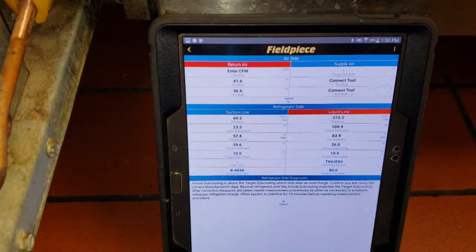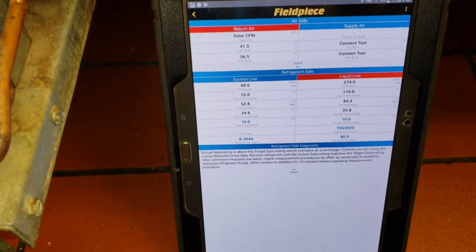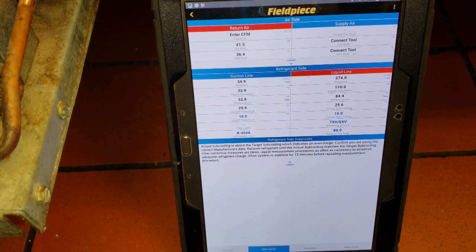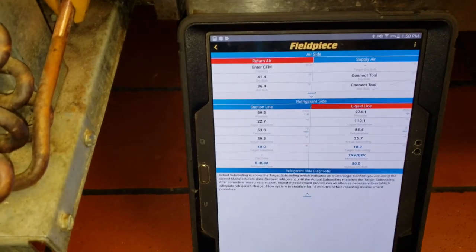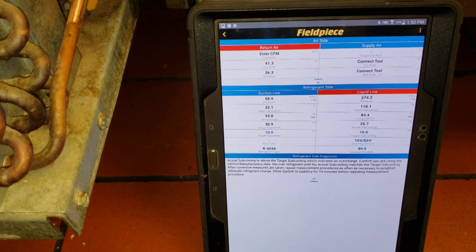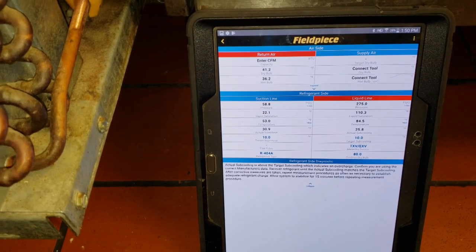The unit's running and coming down in temperature - box temp is at 41 degrees right now. Return air temp shows we're running approximately a 20-degree evaporator TD, which is the temperature difference between return air temp and the vapor saturation temperature. We're waiting for the box to satisfy - we're going to watch it cycle on and off two to three times to get the perfect setting. I'm estimating the cut-in will be about 85 and the cutout about 45, but we're just watching.